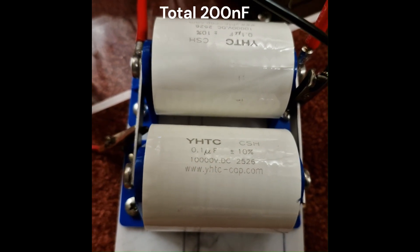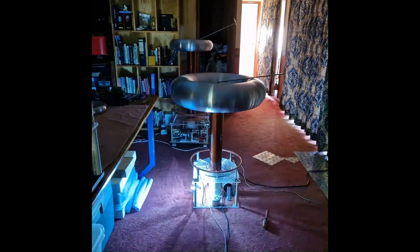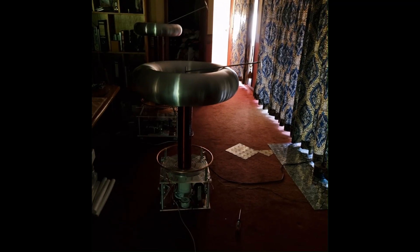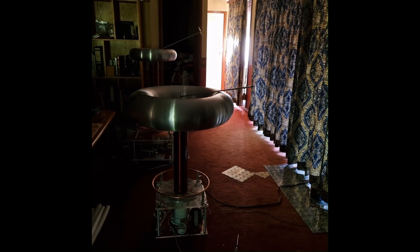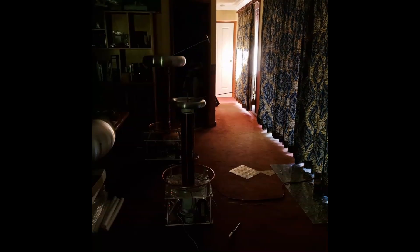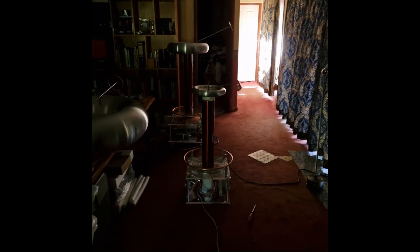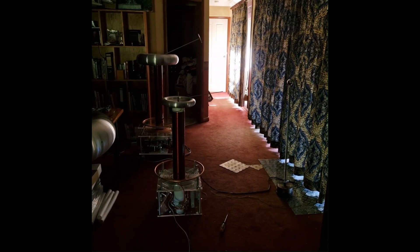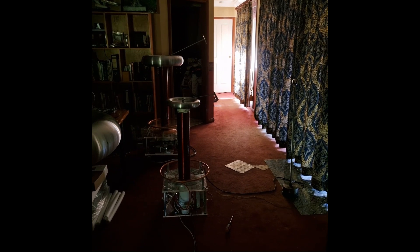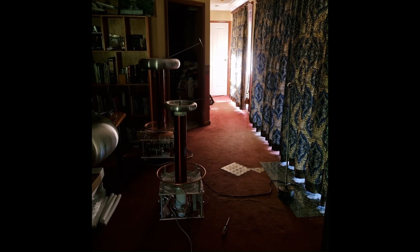I have these two 100 nanofarad 10,000 volt capacitors from other experimentation, so I've wired those in to test with a lower capacitance. Despite tapping on every turn on the primary with the 200 nanofarad capacitor, nothing seems to happen. I'm going to change the top load and see if that helps. From the largest 800mm toroid down to the smallest toroid, and tuning essentially every tap on the primary - no output at all. Despite sparks and everything else going well with the rotary spark gap. I found out that I still had the big 1,000 nanofarad capacitor in parallel when I connected the 200 nanofarad capacitors, so they were all running in parallel making it 1,200 nanofarad - a very big capacitance. I've removed that since. Now tuned with a small top load, and we're about three to four turns out on the primary, and we're getting some discharge.